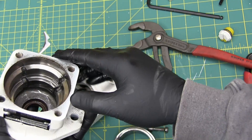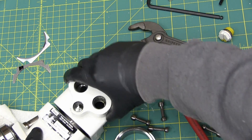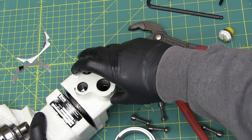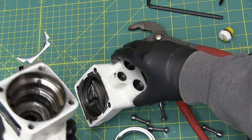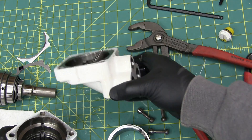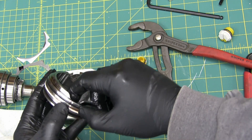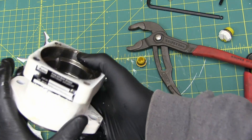How can they get away with that? This is a low-pressure seal. How can they get away with it? Because this is probably 3,000 PSI rated — but the case is vented, is ported back to tank. So this is actually only at tank pressure. This is a great feature for troubleshooting: if you have a component that's suspect, all you need to do is pull that case drain line off and see how much oil is flowing out of there. If it's got excess flow — if it's pissing out of there — then chances are your components are worn right out.